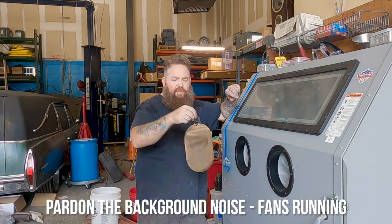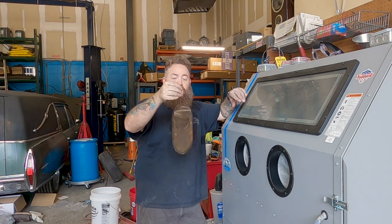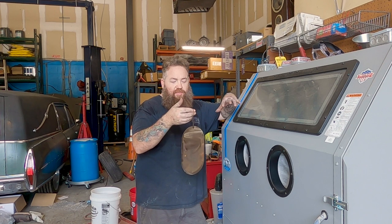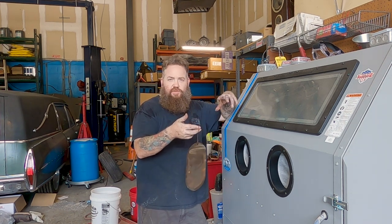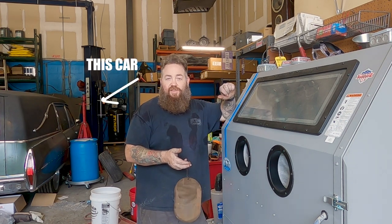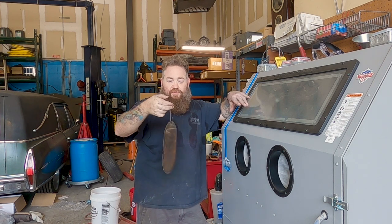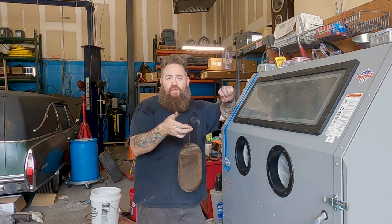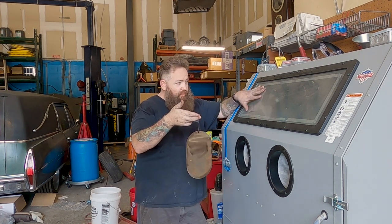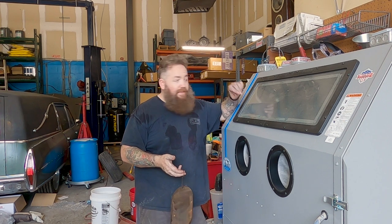What we have here is a piece of scrap I found in the plasma pile. I put it in the oven for about 45 minutes at 450 degrees, which is 50 degrees hotter than the temperature of the powder we're going to spray on it. This is just a spray-out. We're going to hit it with some gloss black, take it to 70% cure, and then put on what's called disco moss, which is supposed to be a metallic green. I have about five pounds of this stuff because most everything in the engine compartment of my car is getting done in this color. The whole point of the outgas process is to remove any oil from the surface — we buy our steel in a condition called pickled and oiled, where they dip it in acid to remove the mill scale and then oil it to keep it from rusting, so you have to cook all the oil off. Then we'll blast it using Columbia's 10X media, which leaves a really nice surface that gives a nice mechanical bond for the powder itself.